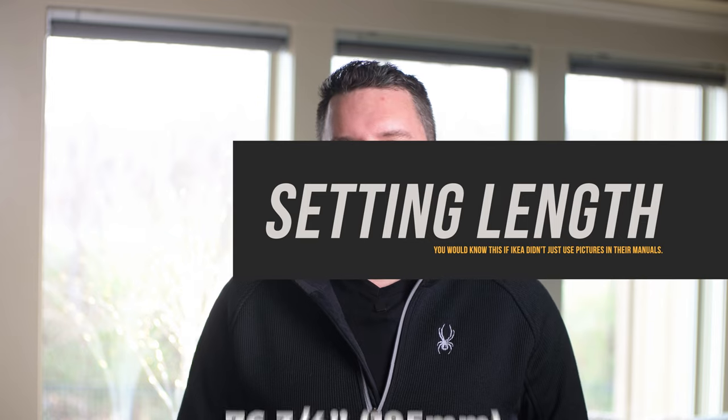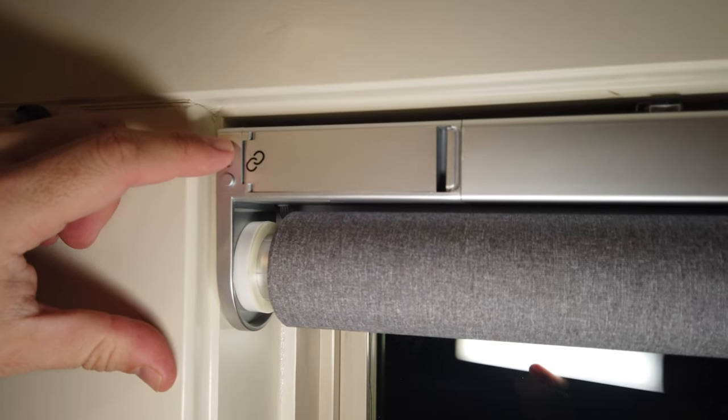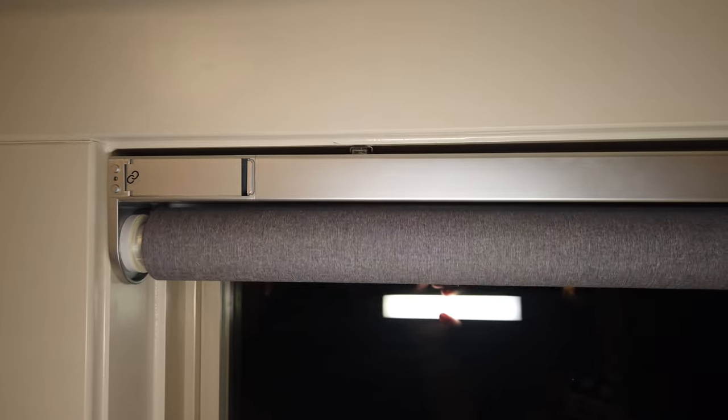The max length of these shades is about 76 inches, but you can set the shade to whatever length you want it to stop at. To do this, first clear the existing length by putting the shade all the way to the top then double-pressing either up or down — not both. The shade should retract and then extend a little bit. Using the manual controls on the side of the shade, set the shade to your desired length. If you overshoot, use the up button to fix it. Once the shade is at the correct height, stop it by pressing up or down one time, then double-tap up or down to set the final length — you'll see the shade move a little bit down and back up again. Now when the shade is closing it will stop right there.